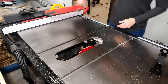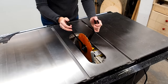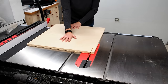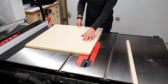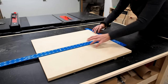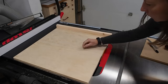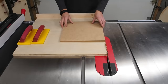I swapped out my old blade for a 50-tooth combination blade. With that done I trimmed off the edge of the sled and created a zero-clearance edge for a nice clean cut. About halfway front to back I made a line through the sled as a guide for making pilot holes and putting a pivot pin into the sled. After finding the center of my board I made a pilot hole and mounted it to the sled.